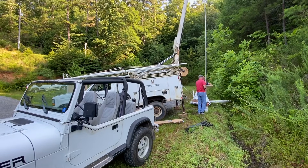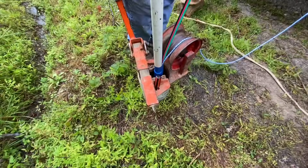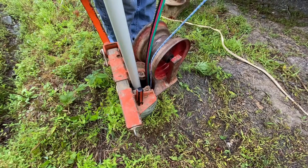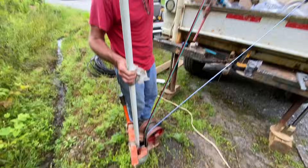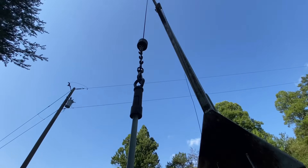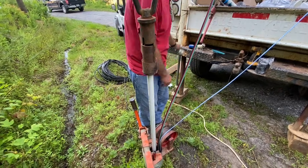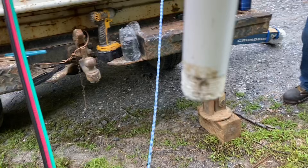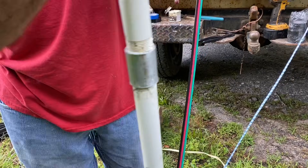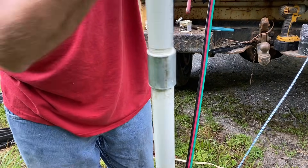Here's another type of plumbing — installing a well pump deep in this well that we have drilled on the property. It's about 700 feet deep, and these pieces of pipe are threaded together and dropped in along with a wire that powers the pump all the way down to about 20 feet from the bottom. Before the piece of pipe is disconnected from the boom, it's clamped right on top of the well head so it doesn't fall down in the well. Then the next section of pipe is prepped, threaded together with a metal coupling, and dropped down in the well. This process is repeated over and over until the well pump reaches the desired depth. If your well is deeper than 800 feet or so, you have to use metal pipes instead of PVC in order to be strong enough to hold the weight of the well pump way down at the bottom.